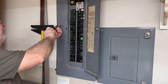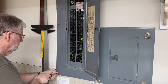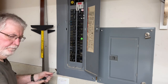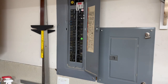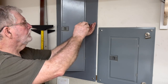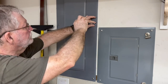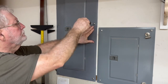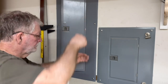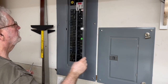Now it's time to put the cover back onto the panel. I do the same exact thing — I put the two screws into the top, then put in the other four screws: the two middle and the two bottom ones. As always, I put the screws in loose to begin with and then come back and tighten them. The panel itself has a little bit of flexibility as far as alignment — you can move it side to side and up and down to get the holes aligned properly. Once they're all aligned, I put in the last screw and there's no alignment needed because it was already done, and I can simply tighten that screw.